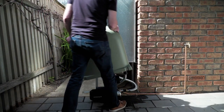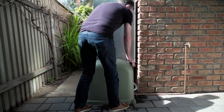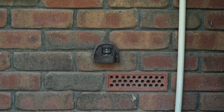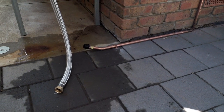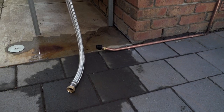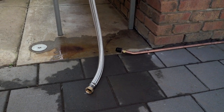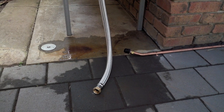Grundfos recommends a covered installation for the jet pump to protect it from the harsh Australian weather conditions. Select a site near to an outdoor weather-rated power point and make sure there is a firm, flat surface on which to mount the pump, like a concrete pad or pump cover base. For added security, the pump can be secured to the base. However, in most installations, this is not necessary.